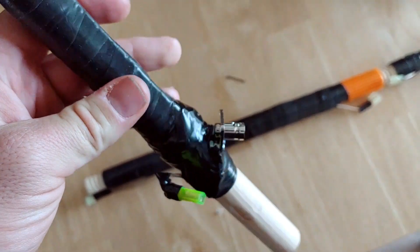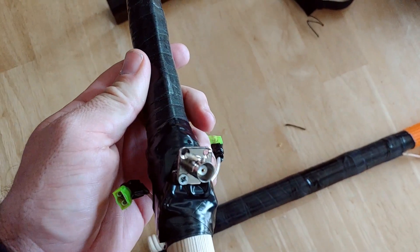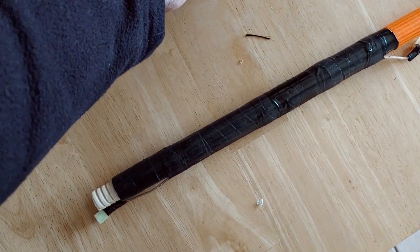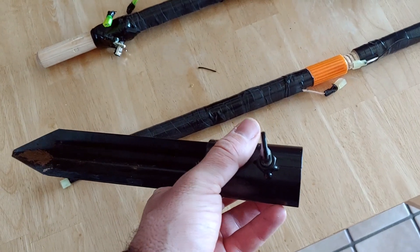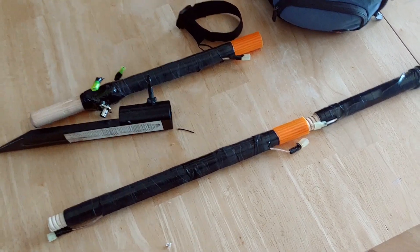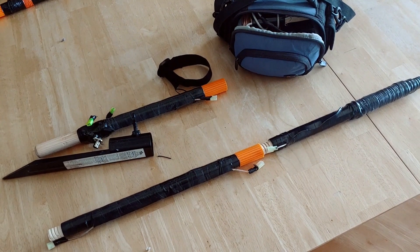And then I made two little pigtails with butt connectors — wires with butt connectors — that are two counterpoises. You can use one counterpoise; two is kind of nice. For 40 meters that's two 13 foot wires that I run out. And then all of this fits into a tiki torch stake, which works really well. It all packs up and just screws together. Plug it in — piece of cake. And I will join you in the yard where I'll show you how it works.